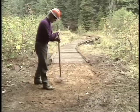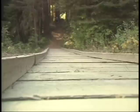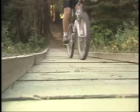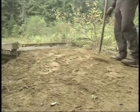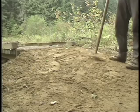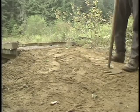They should be straight for at least 10 feet. Decking is often wet and slippery, so any curves approaching or even on the deck add to the risk of slipping, especially to bike riders and stock. The approach should have a rising grade of 5% from ground level up to the puncheon. This prevents water on the trail from flowing onto the puncheon.